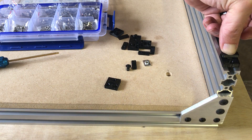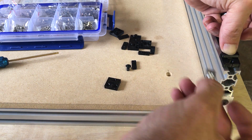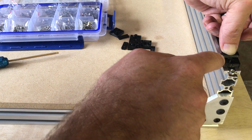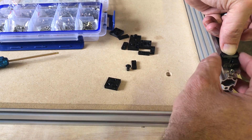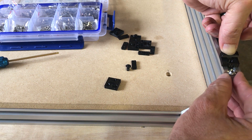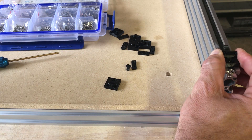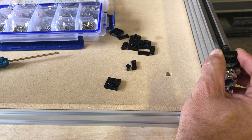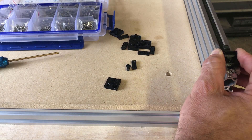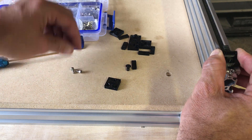We'll have two bolts that go inside and hit the nuts we already put in. I believe we just use the existing piece that'll slide in here and the same bolt will come through and catch this. I'm going to use some M3 12 bolts — actually, no, I think those are going to be too long. Let's go with the M3 8s.